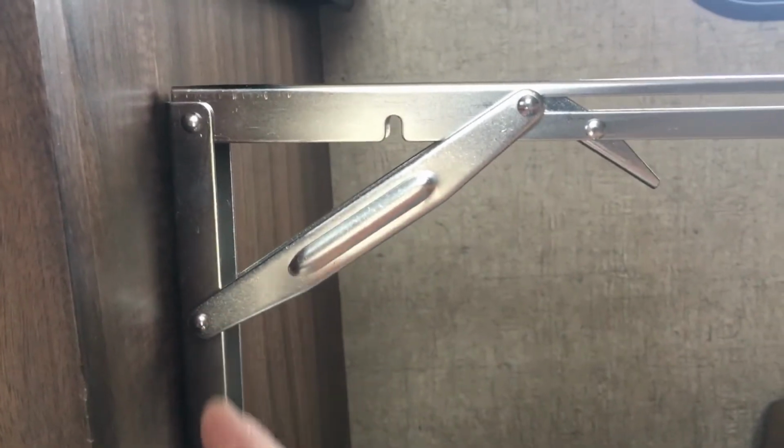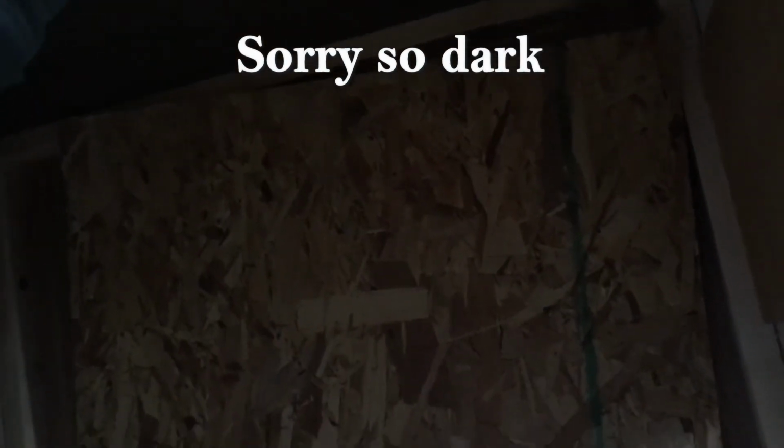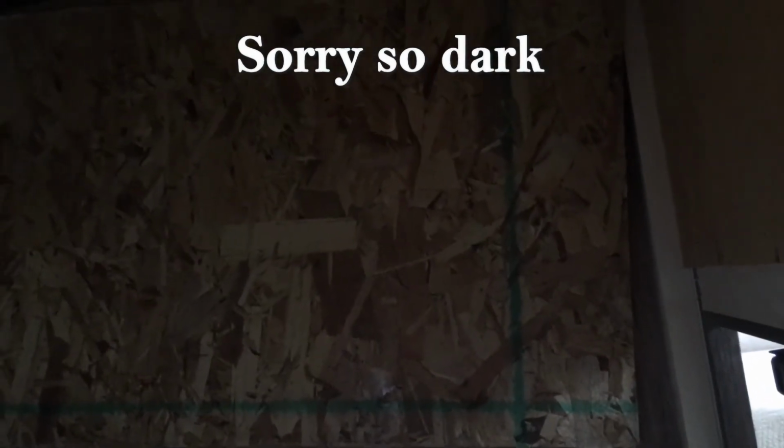This is really just real thin wood, so you have to have something to brace that onto. So what I did, on the back side, I cut a little piece of plywood, used some liquid nails, and glued it up. And I'm going to put a couple of brackets in, and I'll show that here in just a little bit.